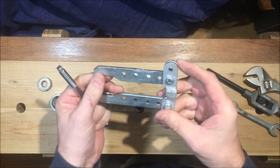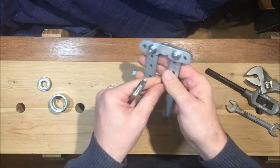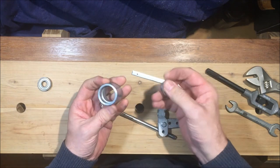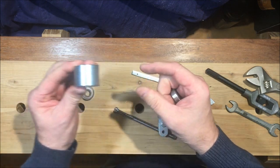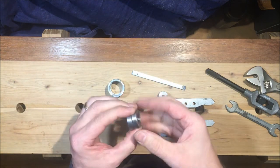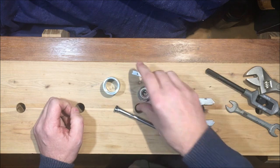We've released both bearings with a simple little tool made from scraps and a coach bolt. Although it's not pretty, it is very effective, by the evidence. Next step will be to fit the replacement bearings into here, and then that can go back. This is the blade belt tension wheel off the bandsaw, and it will be able to go back into the bandsaw once we put the replacement bearings in.